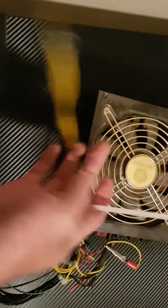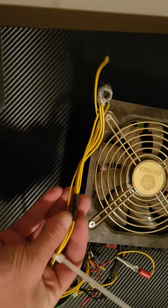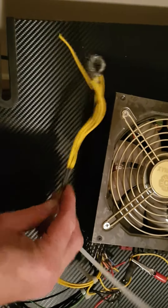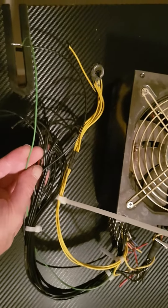And that's pretty much it. On the power supply you'll also see a yellow wire with a black stripe — you don't want those, cut them off and get rid of them. So to summarize: use all your yellow wires for 12 volts, a bunch of ground wires, and your green wire. Once you get this all done, you're ready to go.